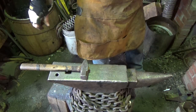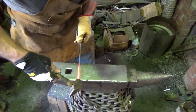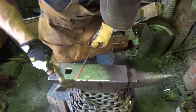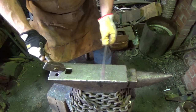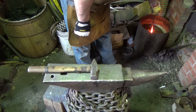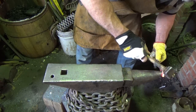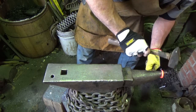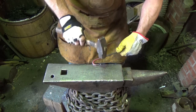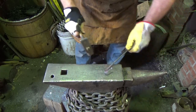I'm tapering that point down pretty thin at the end for the curly-Q. Small stock doesn't take long to heat but doesn't take long to cool either. Go hexagon first and then be picky about it. We just start that curly-Q around the anvil horn until we know what we got, then close it right up. I'm happy with that. From that point we go to put the hook in itself. We've got to be careful not to melt the curly-Q or distort it by hitting it with a hammer, so I'll cool it down and go over the horn.